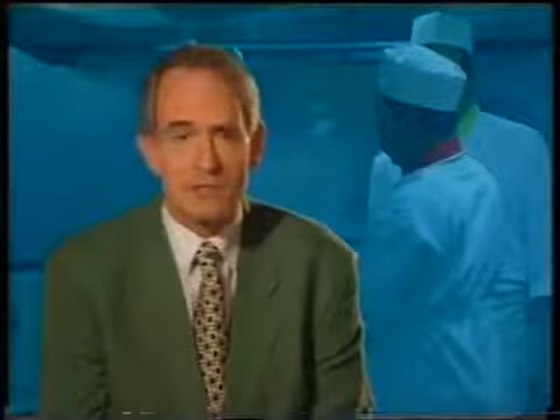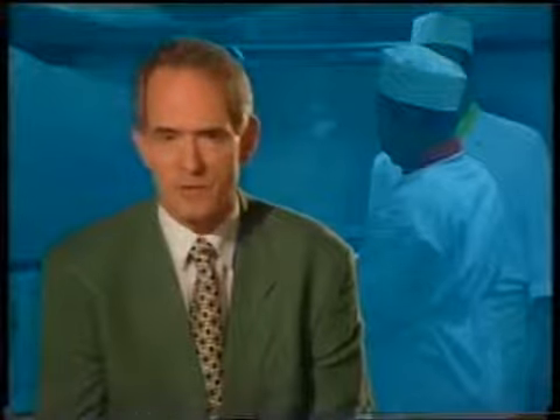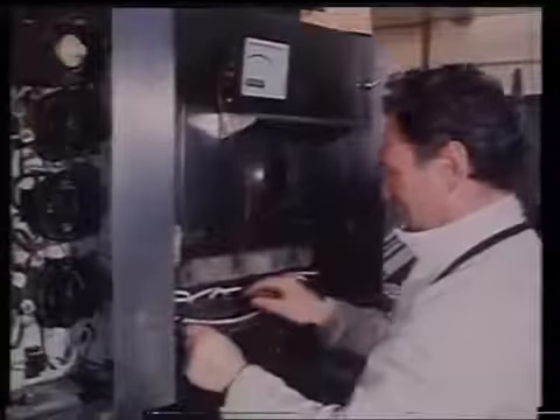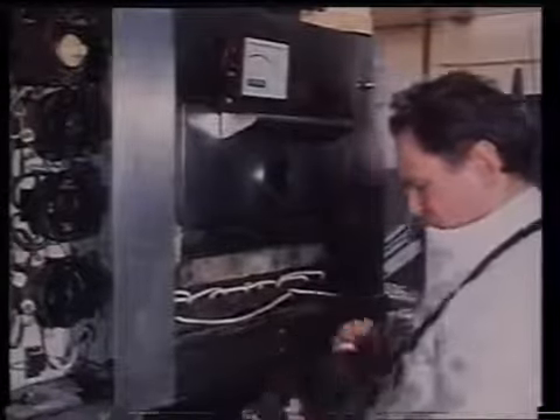Some may argue that the wettest and greasiest place on board ship is the galley. Working with electrical equipment there needs extra care for safety. The electrical power in a galley is largely absorbed in producing heat in deep fryers, ovens, hot plates or water heaters. Most other equipment there will utilise small electric motors with their control switches and indicator lamps. Before any maintenance work is done on a unit, isolate the power supply at the galley section board and check the circuit for voltage with a multimeter — prove it dead. Here, a baking oven is checked; its heating elements are checked to earth and for insulation between each element.